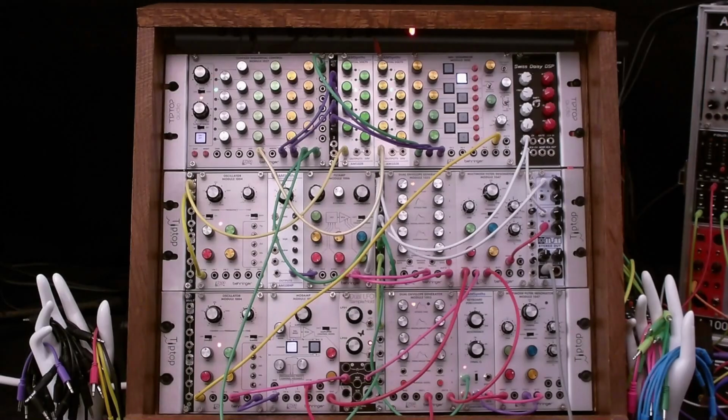Obviously, pitch is important. We've also used the CV outputs to control timbre with wave shaping. You can also directly control pulse width or filter cutoff frequency. Using the CV as a gate allows you to trigger other events. We use those gates to create accent events by triggering an envelope routed to a 1047 filter cutoff frequency.